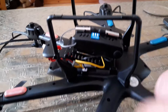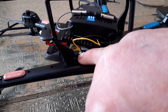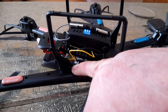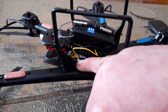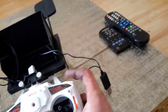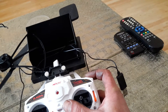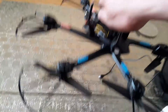The only mod I've had to do is on the wires. It comes with the black wire on the centre terminal — that's probably for the Semi S5 or whatever it's called. But I found by moving the black wire from the middle to the outer front, so the front of the aircraft's here and the yellow's towards the back, you can actually control it with the camera button on your remote. You just press it twice quickly and it records, and to stop, and if you keep it held it takes stills. So it's a really good setup.